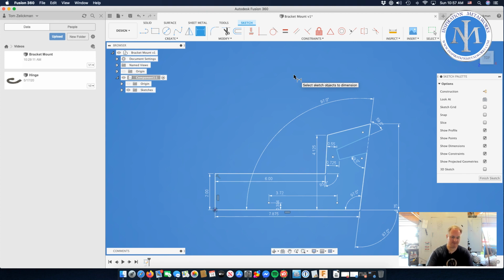As it gets, 875 from the center of the bend. We said that was 2 inches, so 2 inch 875 is what we should be here. I eyeballed that pretty close. All right. So there's that. Now, one good thing about what I can do here is I'll actually burn this out on the plasma table before I do anything else. I'll get the general design in place and poke some holes in places and see how things line up and decide, am I right, am I wrong, do I need to make some adjustments?